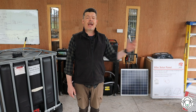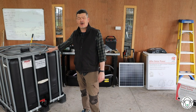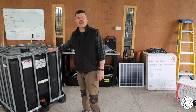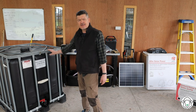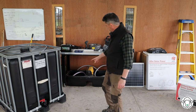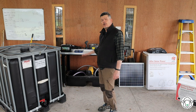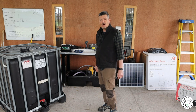So what we do is we pump the water out of the stream using a solar powered pump. We pump it into this IBC which is a big container - the reservoir if you like - and this contains one metric ton of water or a thousand litres. Then what happens is it's gravity fed into the trough that you can see below, and the trough has got a ball valve in, and that keeps it permanently topped up.